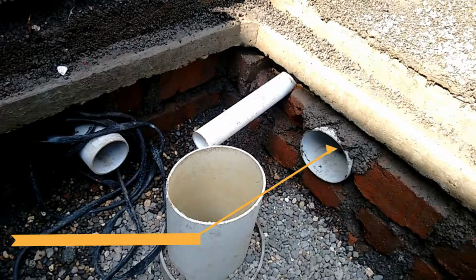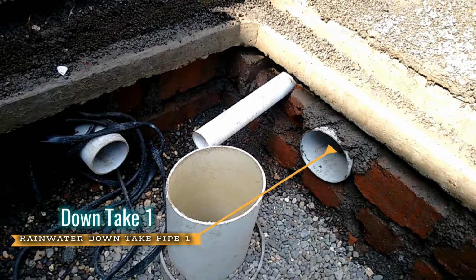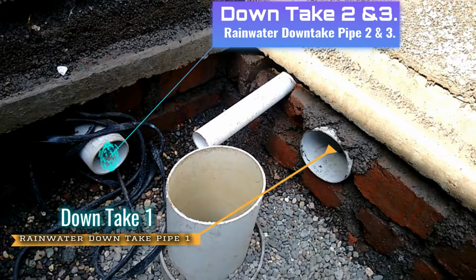We request all customers to do the survey and take the borewell for the rainwater harvesting. Without the survey, if we blindly follow and the groundwater channel is not cut during the drilling, it's a kind of bottle without any groundwater channel. Only if there is a groundwater channel in the borewell does the water get taken in by the borewell. So the intake capacity of each borewell is utmost important, more than implementing rainwater harvesting in a failed borewell. So I'll walk you through.